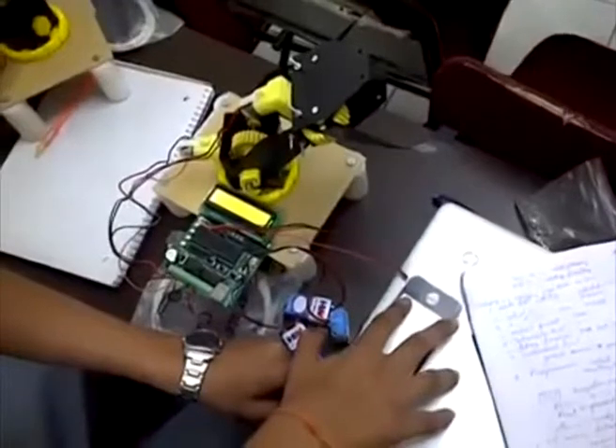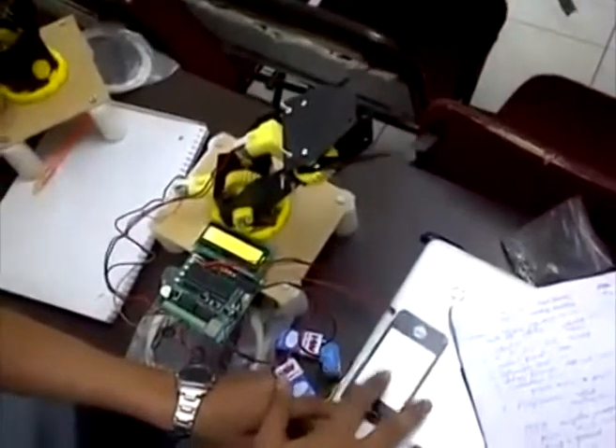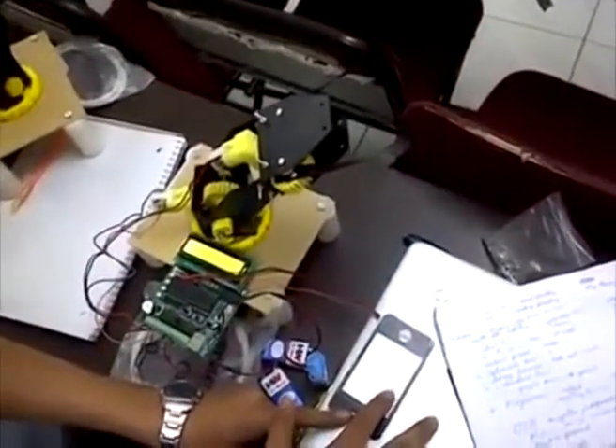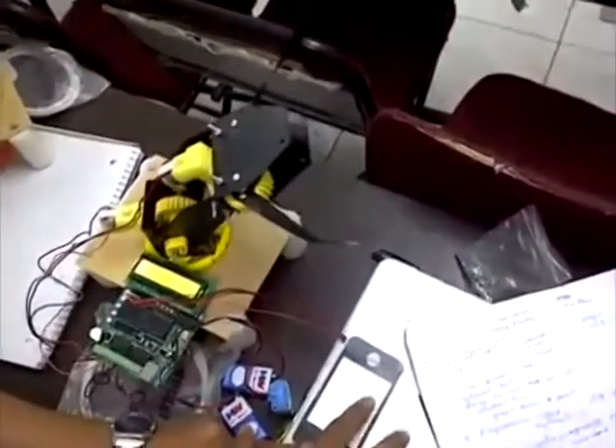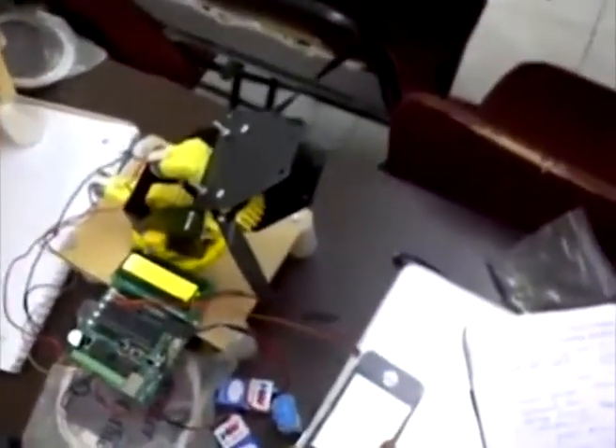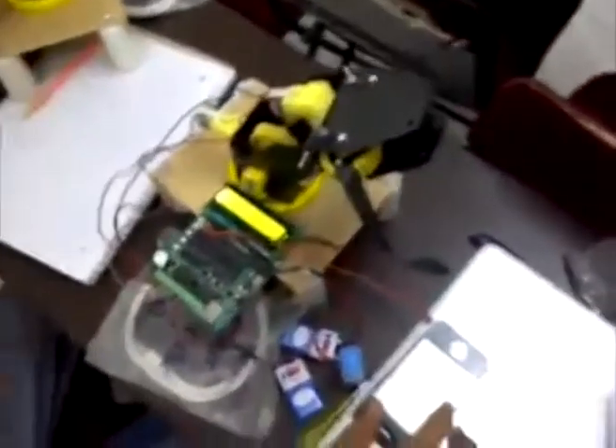The robotic arm is controlled by a four-wire resistive touchscreen having three degrees of freedom. There are basically six buttons to press, and during calibration we define six positions by dividing the touchscreen into six square planes, which serve as buttons.